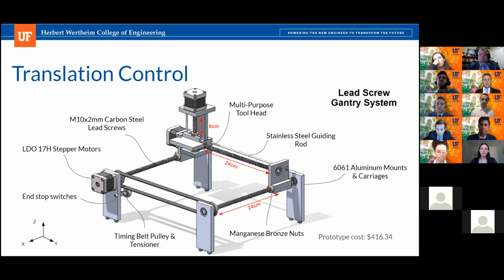Okay, so they're not going to be. So what we're having is a DuPont Teflon lubricant, which is nonstick. It's kind of like a dry lubricant, and they're used especially in these types of scenarios in 3D printers, for example, that use steel lead screws. So the lubricant will just be placed entirely in the thing, and since it's not very viscous, it's like a dry lubricant. It would stick there and would not come off. Therefore, you prevent corrosion by doing that. So that's what we had in mind, as to prevent corrosion. Okay.